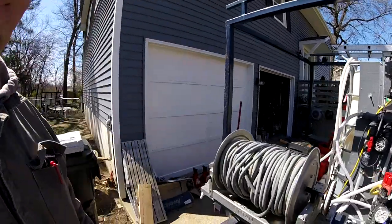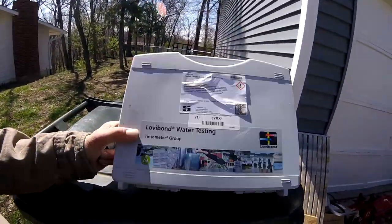Or, 'I'm trying to do a house wash and it's not cleaning and I had to keep bumping my valves up. What's wrong?' Well, there are a couple of things that could be wrong. One is, in a previous video you saw where I was getting screwed on the purchase of my SH — I was buying 12.5% and only getting supplied 7% to maybe 8.5%. The only way I know that is I bought this tester here and I was testing my SH.